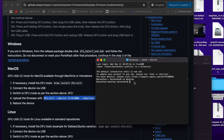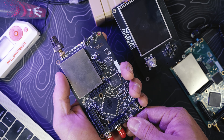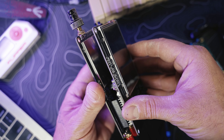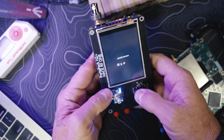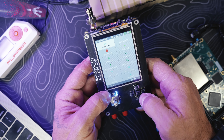Paste that command into terminal and hit Enter — it goes pretty fast. You'll see 'DFU compatible USB device found,' your device ID, version info, and the download command running. You'll see 'Download 100%' and 'Download done.' After that you'll see a libusb error 10 — that's perfectly normal. Unplug the board.